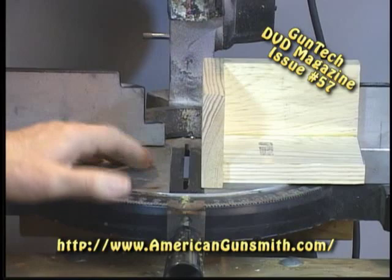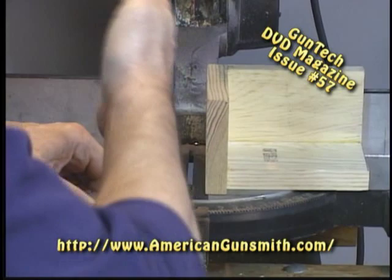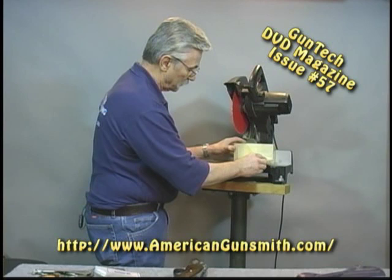Now why is that? Well, because when I lay this piece up here and clamp it down, I need to know that it's exactly parallel with the blade this way and parallel with the blade this way. That's imperative — that's what we're doing here on our system.